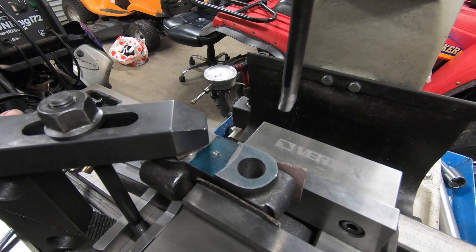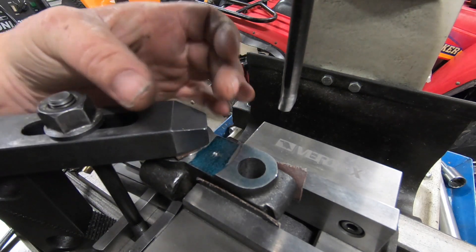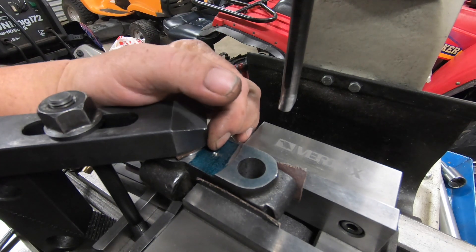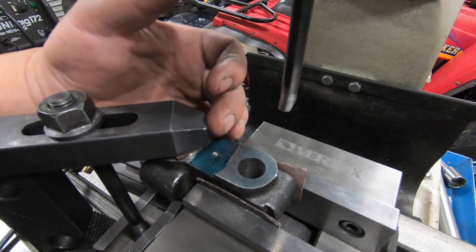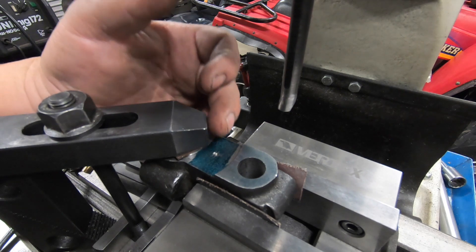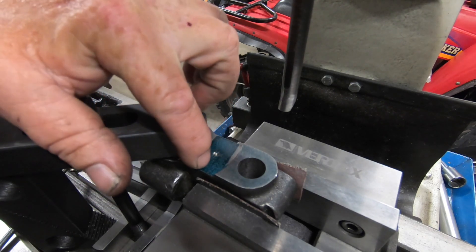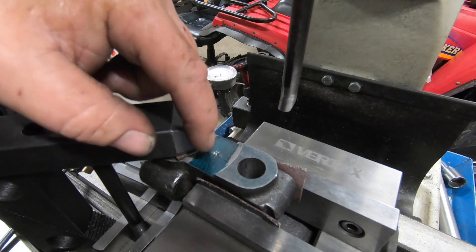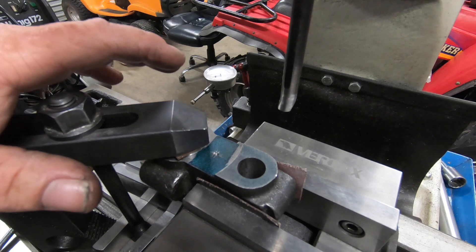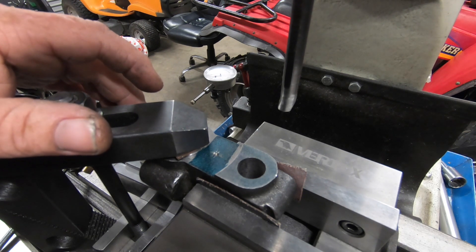It's about 11 o'clock at night and I've been thinking about this for hours. This has to have a three-inch back plate put on here for the indexing ring to register on. It has to have a spring-loaded plunger in the casting here — it goes through the back plate and pushes on the indexing ring, locking into holes. I'm not going to put this hole in yet until I get the back plate made and screwed in. Then I can drill all the holes in one go so I know I've got a positive fit with no trying to line up. Takes the guesswork out of it.